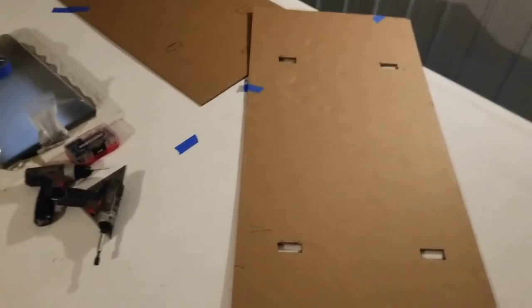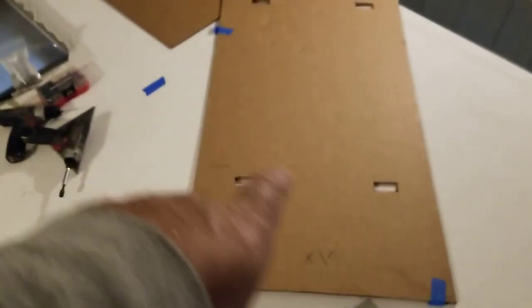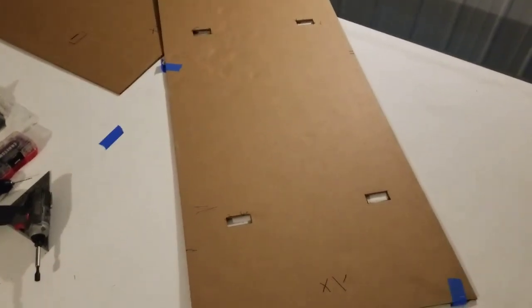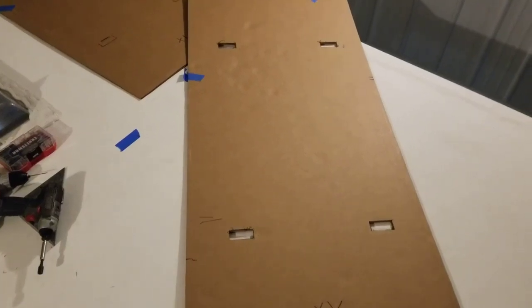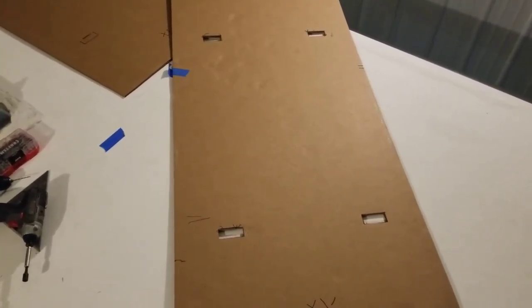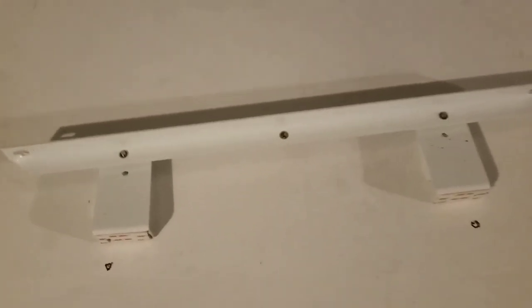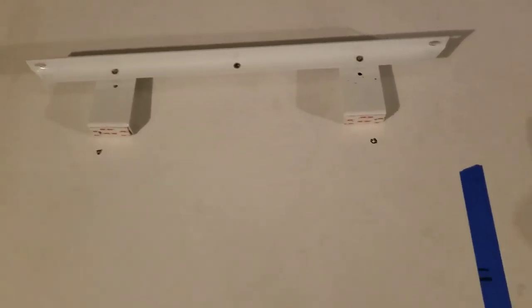Here's my first attempt at getting these panel mounts mounted to the roof. I took some of the packing cardboard from the solar panels, assembled the tilt mount assemblies to the panel, cut the cardboard to the exact size of the panel, set it on top of the cardboard, and got the footprint of where those mount pad legs go. I laid it up where they're going, put the first one in those cardboard cutout slots, and did one hole on each leg. I've got really good structure — the wood screws that came with the solar panels sucked down really well without stripping.